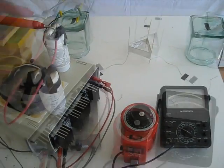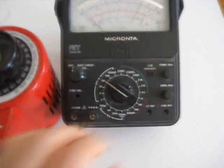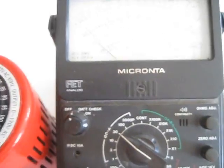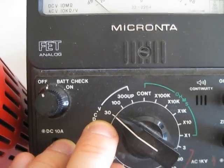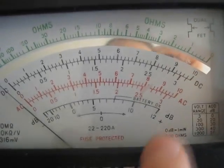Let me just quickly show it to you in action. The probe is good for a 10 mega ohm impedance multimeter, which luckily I have. Now to use it, my power supply is capable of putting out 30 kilovolts. So I'm going to put the meter onto the 30 volt DC scale right there. Now to convert the voltage, what I do is I multiply that by 1000 for this particular probe. So 30 volts will be 30 kilovolts.